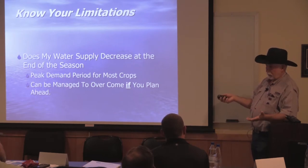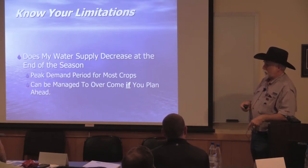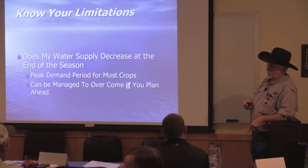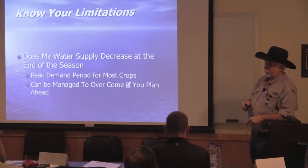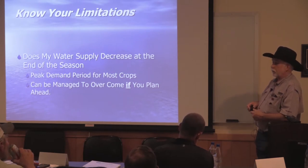I'm still putting out a good amount of water. On this system, right now it's going to be at 300 gallons a minute, with 50 gallon a minute zones. But that system will still be efficient down to 35 gallons a minute. You'll still be able to pressure up one zone at a time at 35, and never have to dig anything up, because I'm opposed to digging if it doesn't involve a ditcher or somebody else, because I don't dig.